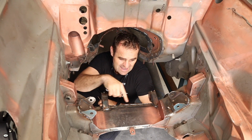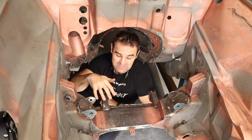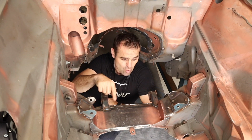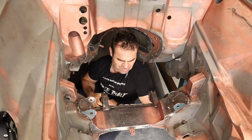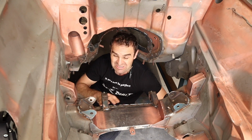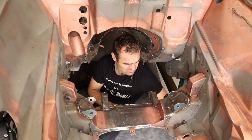The next thing I'm going to have a look at is the center brace. I know there was a lot of concern when I cut it out from the car, and I'm going back now and adding it in. I did add in a lot of extra reinforcing when I put it in there. Underneath this plate, for those who can see it, there's a bunch of square tubes, and it's all welded in and tied in. I'm going to go back now and do some more triangulation in these corners, now that I know where the engine needs to sit. I can add a bit extra reinforcing again, and I think this will be more than robust enough for the job in the middle here at least. As I said, I've also boxed it back further and forward, so it's substantially stronger than what it was before. So we're just adding some gussets to give that extra little bit of strength, and that's the next job.